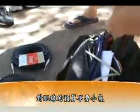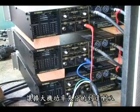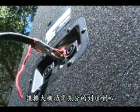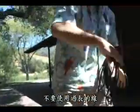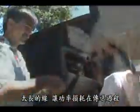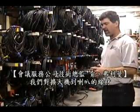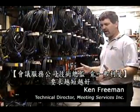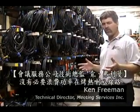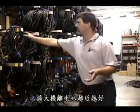Don't skimp on cabling. Use large gauge wiring to assure that all the power the amplifier provides actually goes to the loudspeaker. You should also eliminate excessive extra length. If your cables are too long, you're wasting some of that power that could be getting to the loudspeaker. We always try to minimize the amount of cable between the speaker and the amplifier because they sound better. There's no reason to waste your amplifier power heating up the copper in the cable.